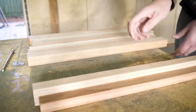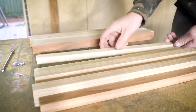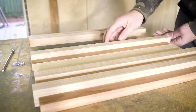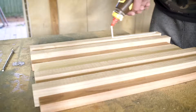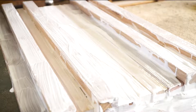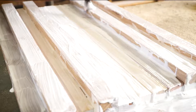Place your pieces in the order that you want them, then turn them sideways at a 90-degree angle. Make sure you turn them all the same way so that you keep all the good sides facing the same direction. Next up is the gluing process — don't skimp on the glue because you can always wipe off the excess later. You really want to make sure you cover the whole surface of each piece of timber.